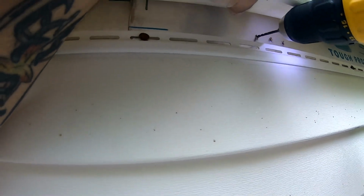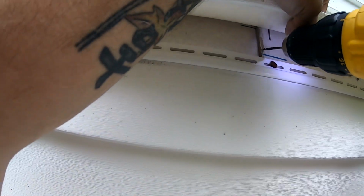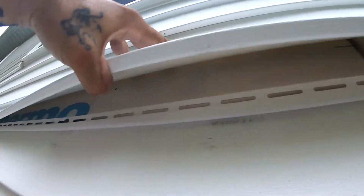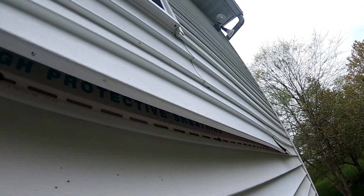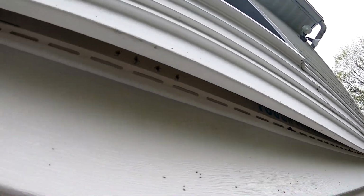This Franklin sensor lied to us. So if you see what I'm doing here, I drilled a few holes looking for that stud in that area, and I was unable to find it. Well, you can keep going along the wall like that, and you can do it until you find a stud. Most times when you're dealing with vinyl siding, the nails are not going to be strategically placed into every stud. This house is an anomaly. You're not going to find that. I promise you, you're probably not going to find that out there in the wild.